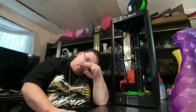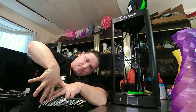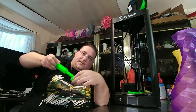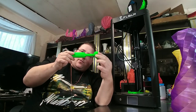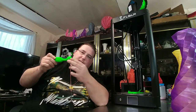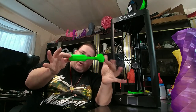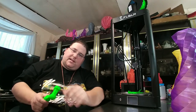Because you have a single point with three arms. Well, if I push this one arm, this is going to come down, but it's also going to move sideways and tilt. Okay? So if I were to take this and push it from one corner, it's not going to do this. It's going to do this. Because these two arms are holding it. So in order to do this kind of a movement, all three arms have to move up and down together in a choreographed fashion in order to make a part move on a plane when it's connected by a three-point attachment to the rails.